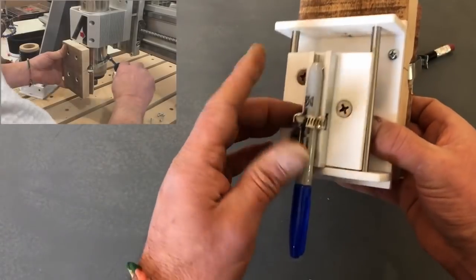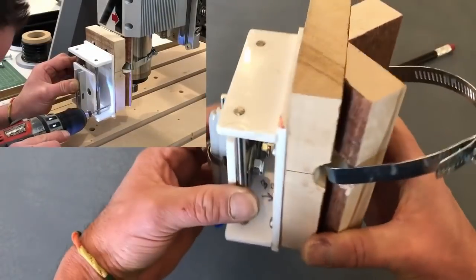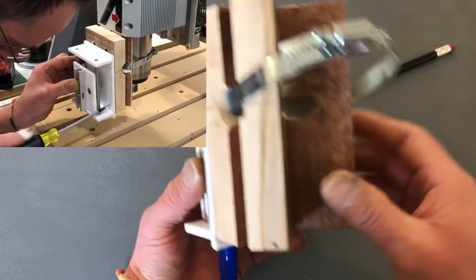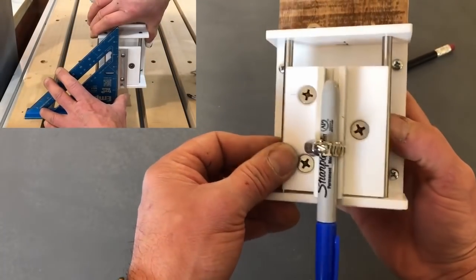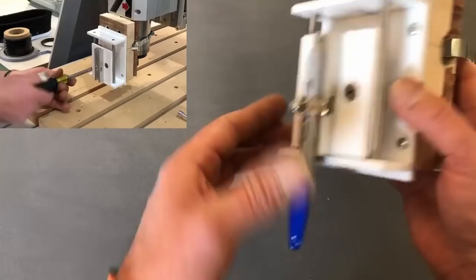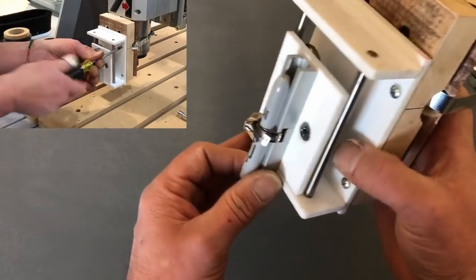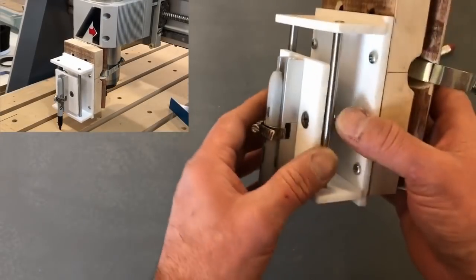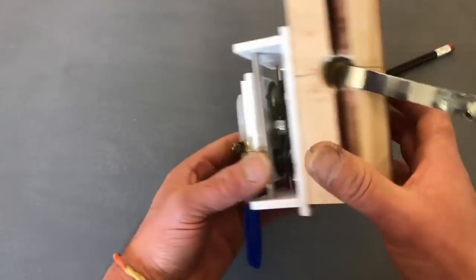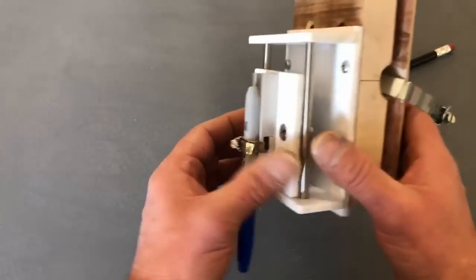The other beauty of this is, since there is no spring, it has a lot more flow to it. When you bring this down to the bed of your machine and set the Z-axis height, you want to set it so it's got a little bit of upwards lift. Then when this thing goes around, it will travel up and down — it will float. You have a lot more float than with the spring setup. The universal attachment means you can put whatever you want in there — even a crayon if you wanted to.